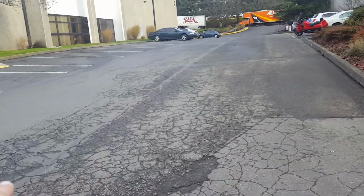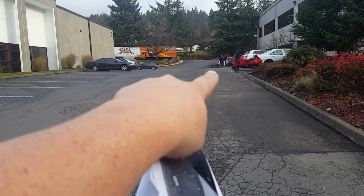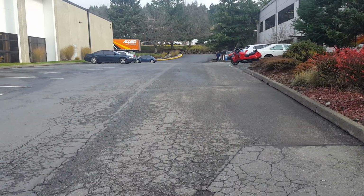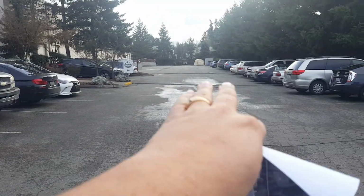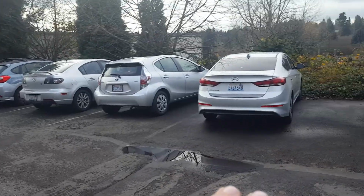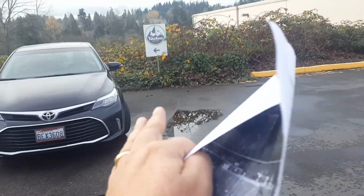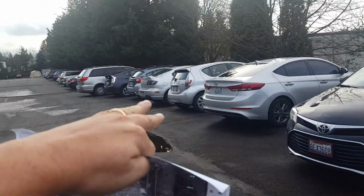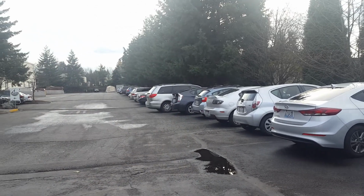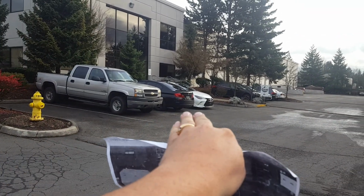But from the curb here all the way up to the last stall where that truck is and over, you've got like 15 feet here by whatever the dimension is here. I'd like you to include this as a 3-inch grind and overlay, and then also take from this stall, which is right down the center of the road here, I'd like you to include all these stalls all the way down to the end of the property as a 3-inch grind and overlay. Grind and overlay in here.